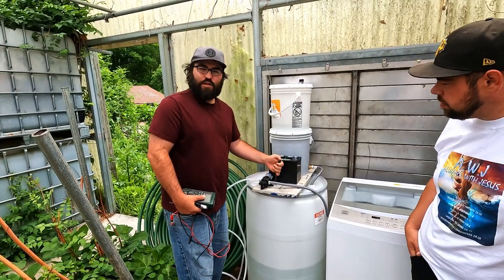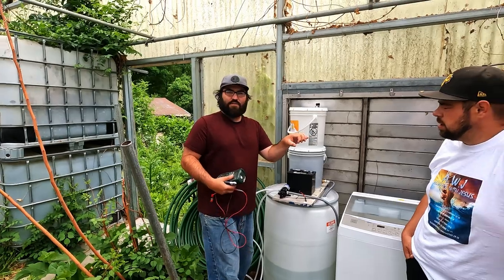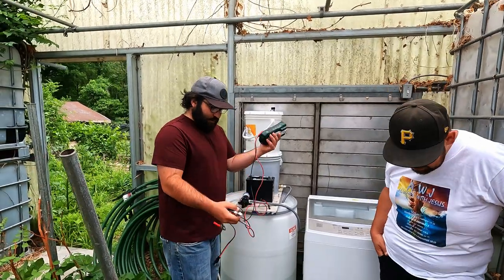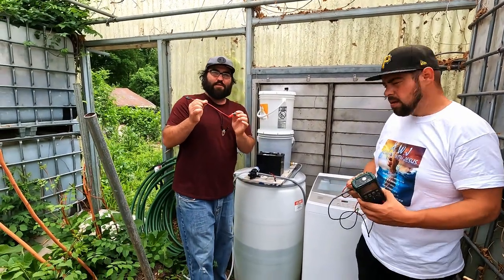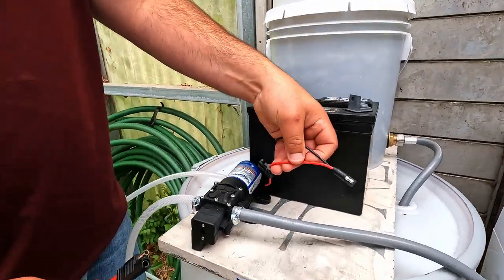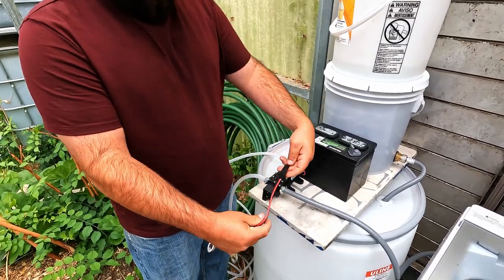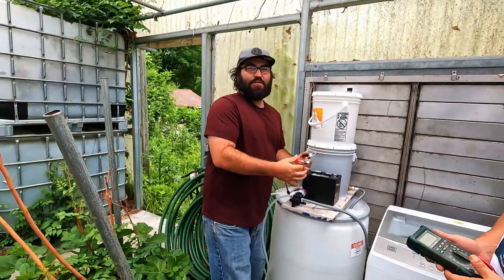This uses your standard 12-volt plug that you'll see on cheap solar panels. But you've got to be careful because when you plug things into these, it's usually just a black cable and they all plug in together, but each plug reverses the polarity. I've fried out 110-volt inverters on camping trips, and a lithium-ion battery tester, because I used a little 12-volt plug. So I always use a volt meter. The prongs are red and black, but this one shows which should be hot, and they're the opposite — so the red now needs to go to ground instead of black.